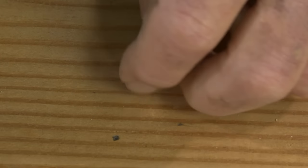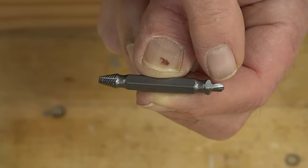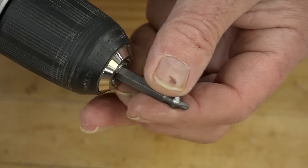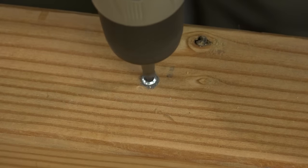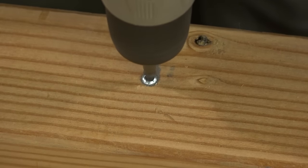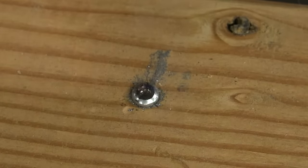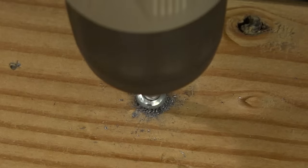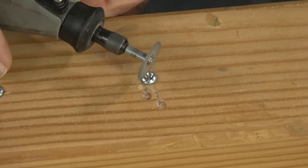This tool is designed specifically for screw removal. Each bit has two ends — one for burnishing and the other for extraction. Set the drill for reverse and place the remover into the drill chuck with the burnishing end protruding. Press the tip of the burnisher into the center of the stripped out screw head and run the drill at slow to moderate speed with downward pressure to create a depression in the screw head. Then flip the bit around so the extraction end is protruding, and again run the drill slowly in reverse with steady downward pressure.